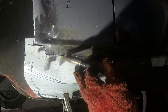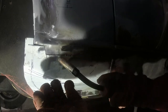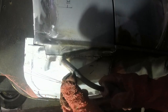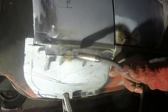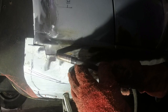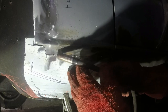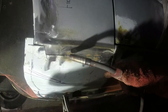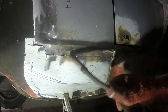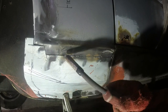Because if I go, I'll do this one going that way now, but what you'll see is that it doesn't matter so much here, because this is actually quite a clean area, because I've been wire brushing the hell out of it. If this was crap and metal and I'd been going that way, I'd be trying to weld onto dirty metal, as it were. Whereas if I'm welding back, having just welded a bit, it's clean, if that makes sense. So you'll see this first one where I've got those oxides, I'll have to pull the trigger for quite a long time to get it to weld nicely. But I'll do it wrong and I'll go that way.